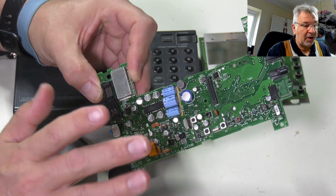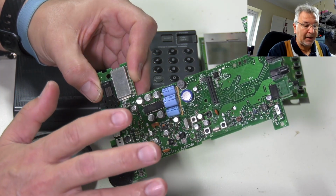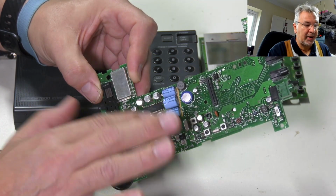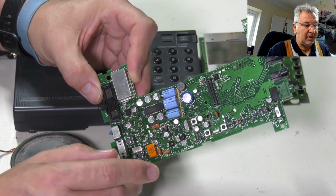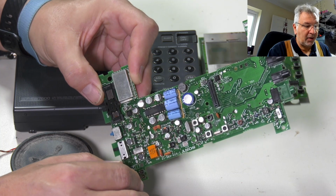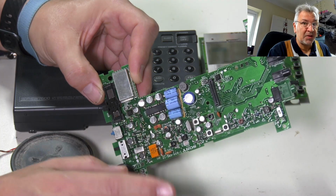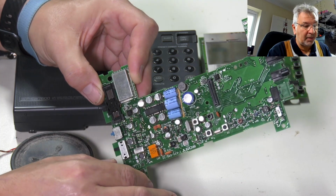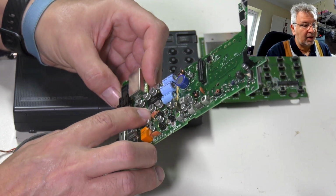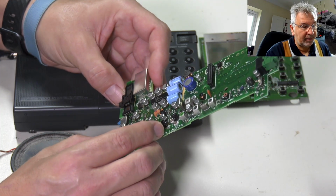There are some that are very close to plastic components, so I can't do those with the hot air really. You can sort of mask it up, but it's surprising how the hot air gets underneath masking tape. And I've got some foil tape that I use, but really for those ones that are close to plastic components, I'm going to have to try and either twist them off or lift them with a soldering iron. So we'll deal with that when I get there. I think I've lifted 4 off so far. 1, 2, 3, yeah, 4 I've lifted by the looks of it.